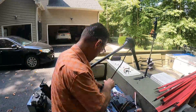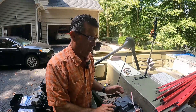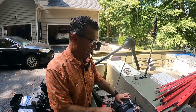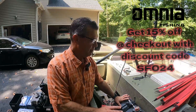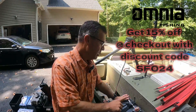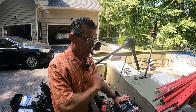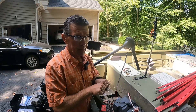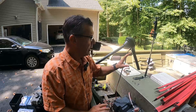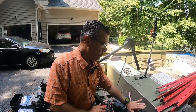In just a moment I'll explain why I can't use the 100 amp-hour batteries I have in the back to run the new motor. But something important, especially when running lithium batteries: you always want to have a kill switch from any of your components going to your lithium batteries. I've been working with lithium batteries for a couple of years, and if you don't have a kill switch, things will continue to drain on your batteries, which is not good for lithium especially when you're trying to charge them. I have a kill switch and I'll have the same on my next motor — you want to have a kill switch or completely unplug whatever component is plugged into your lithium battery setup.